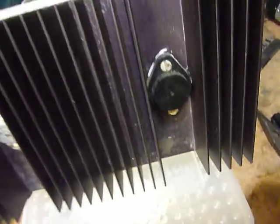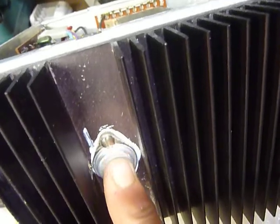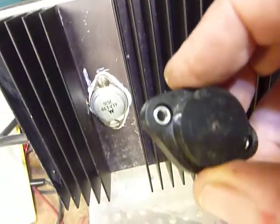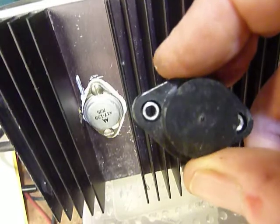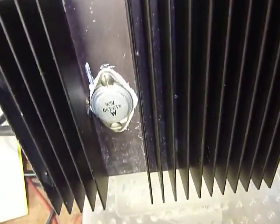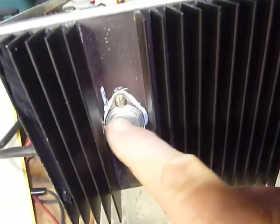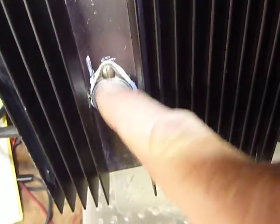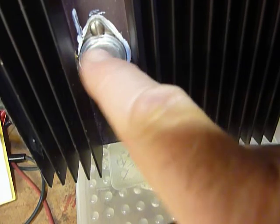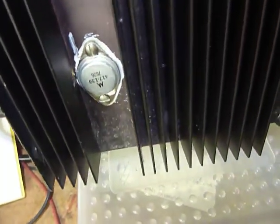So what I decided to do was to replace those screws with these three-quarter inch stainless steel screws and leave those plastic caps off. That way you're not conducting through those aluminum bushings, which eliminates another source of a possible problem. You do have to be careful not to connect something between the heat sink and the transistor that would short it out — that is possible — but I would prefer to have it that way and have a better connection.